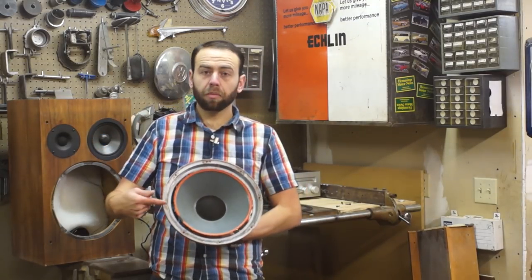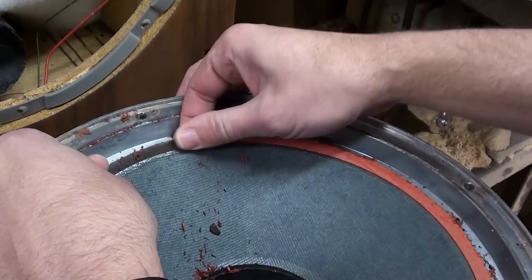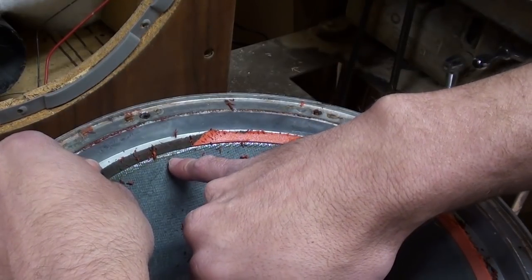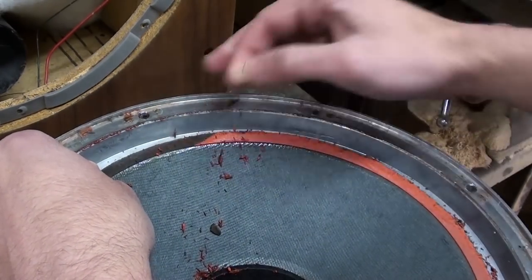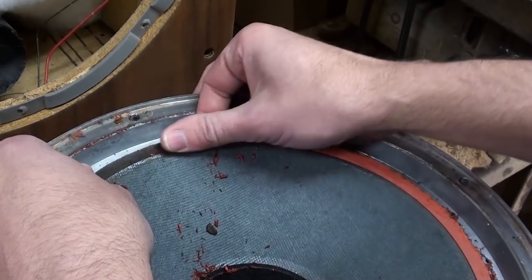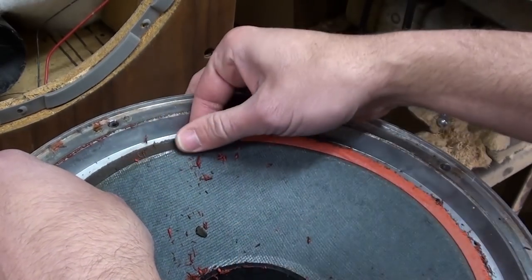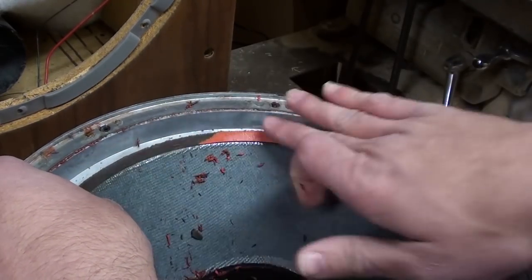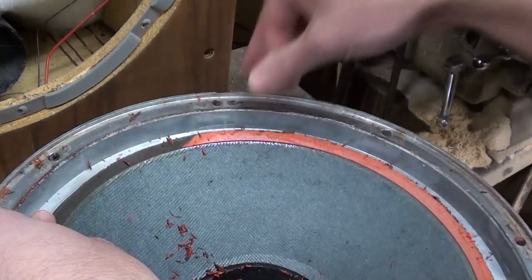You can see that's starting to remove this bit of foam. Now one thing to be careful of is not to damage the paper of the driver itself. There's a little bit of factory glue there that's protecting the paper. If you rub on the paper too much it can start to fray and come apart. So carefully go right around that edge, staying where the glue is protecting it, and slowly remove the old foam. This just leaves behind a little bit of glue, which will provide a nice tacky surface for when we apply the new surround.